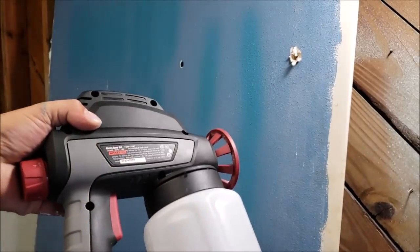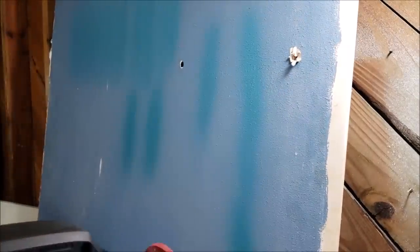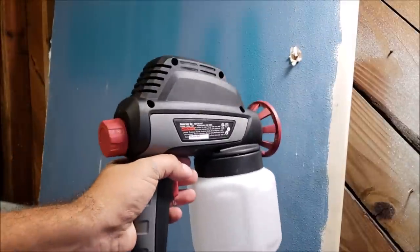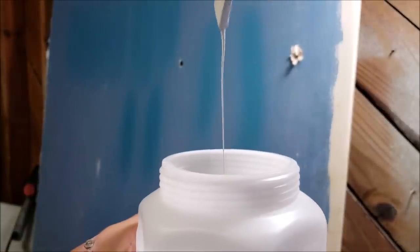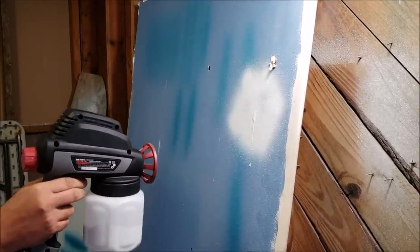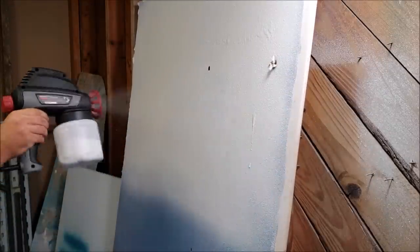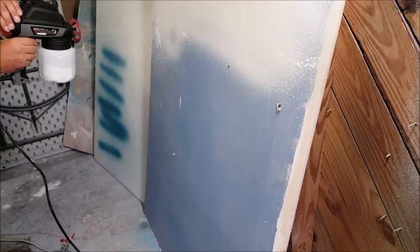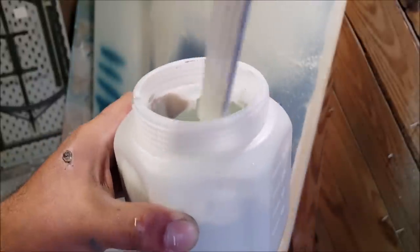The point of the more expensive electric sprayers is to throw a lot of paint with a huge fan so you can do one coat and cut down time — paint a room in a few minutes instead of all day. I'm going to put some paint in here straight out of the can and let's see what it looks like when you spray too thick and the wrong way. See that? Paint right out of the can — way too thick to spray. After thinning it with water, it's a lot better. Let's see if that was the problem.